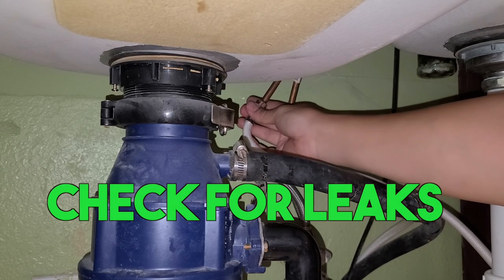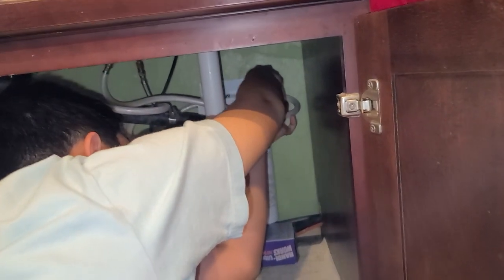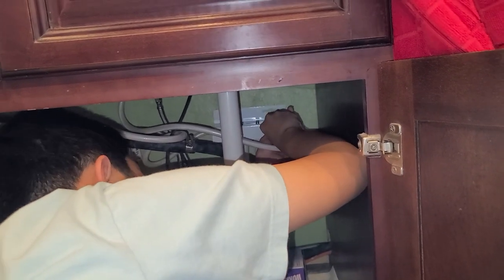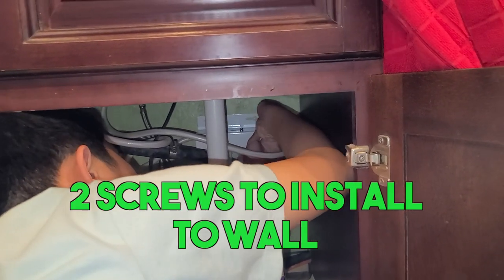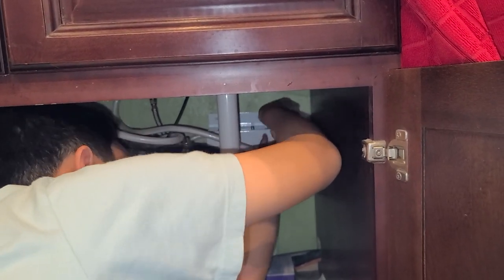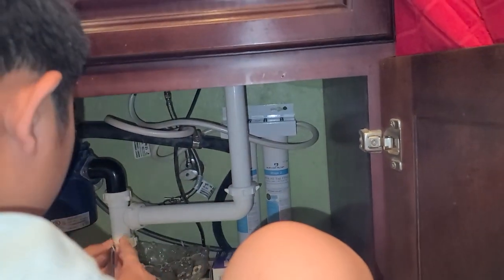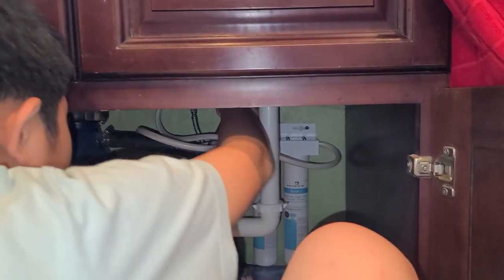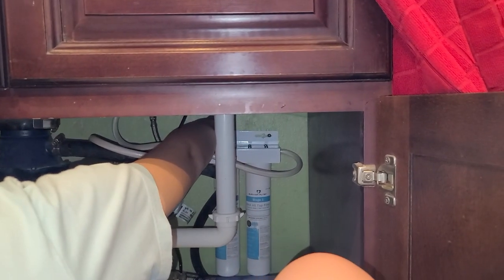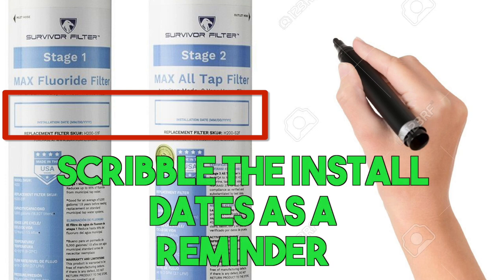I don't see anything there — no leaks. Once you're done doing that, we went ahead and installed the mount on the wall so that it will get out of the way. In order to change the filters in the future, all you got to do is twist off each filter. Now, one thing you want to do is note that the Stage 1 and Stage 2 filters do filter different amounts of volume of liquid. You want to mark it when you installed it, so that within one and a half or two years you know when to change it.